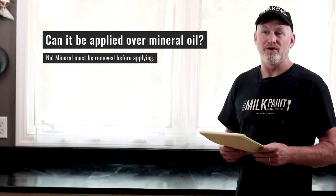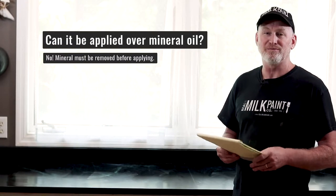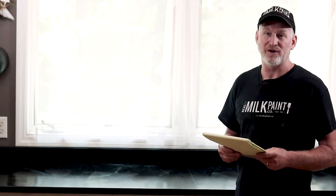Can you put it over mineral oil? That's the one big no-no. Mineral oil is a non-drying oil, so it fights with the drying walnut oil and can cause negative reactions — it can get frosty, white, or stay sticky. You really want to flush all the mineral oil out of the surface, whether with soap, TSP, or by stripping the surface, before applying the soapstone sealer and wood wax.